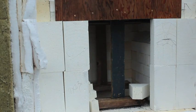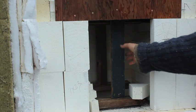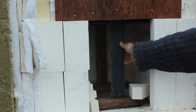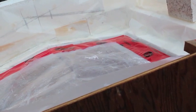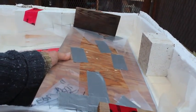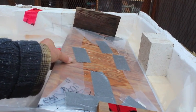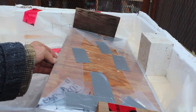Here's the bottom of the crown form and the support to hold it up. It's going to be a couple hundred pounds of wet cement on this, so it has to be really strong - if it broke through that would be really messy. The upper piece just slides into place, and I'll fasten it from the top and put the refractory in through this space here, pushing it down into the far corners.